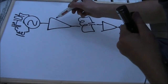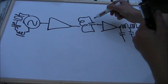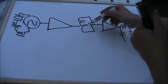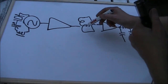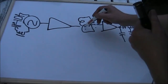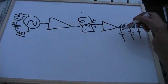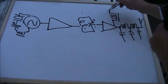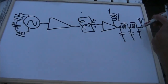Having sorted out the VXO, we have a buffer. Some buffer outputs are untuned — it might be broadband circuitry or just a coupling capacitor — but this particular one has a narrow tuned circuit, and we'll need to change its resonant frequency. You double the inductance and double the capacitance to go to half the frequency, or you halve both to go to double the frequency. There's the power amplifier, which may have an output tank — it may be broadband or it may not. And finally, our low pass filter — definitely need to change that.